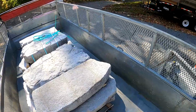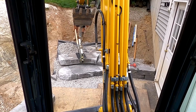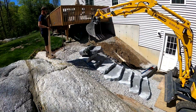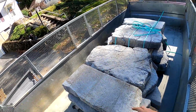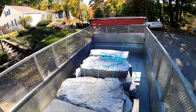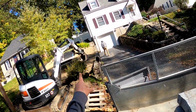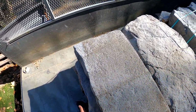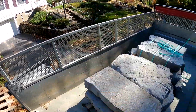So if you guys watched a video a long time ago on my channel, I built the staircase with these. And we used a clamp because I had a mini excavator that did not have a thumb on it. The clamp didn't work the greatest just because of how irregular it is and how the texture is on the sides. It just wouldn't grab tight all the time. Today we're going to be using just the thumb on the mini excavator. We're going to put a little piece of cardboard that's thick just to protect the face, and we're just going to pinch the step, pick it up, and put it aside.